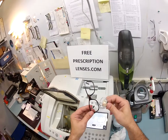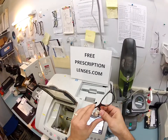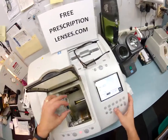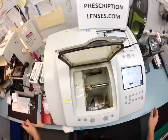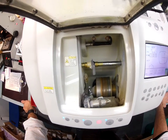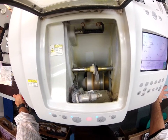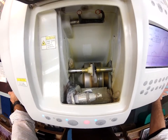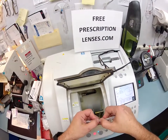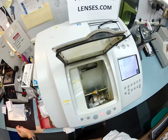To see if it fits, I tuck the lens in at the outside corner and press down at the nose with my thumbs. It's still a little snug, so I'm going to take one-tenth of a millimeter off. I'll program that into the computer and hit the retouch button. I always start a little bit large — you can always make a lens smaller, you can never make it bigger. The bevel wheel will slowly go around until a tenth of a millimeter comes off around the entire circumference.